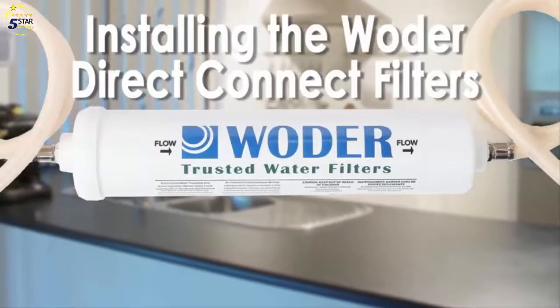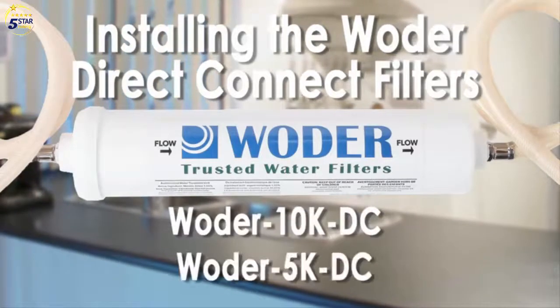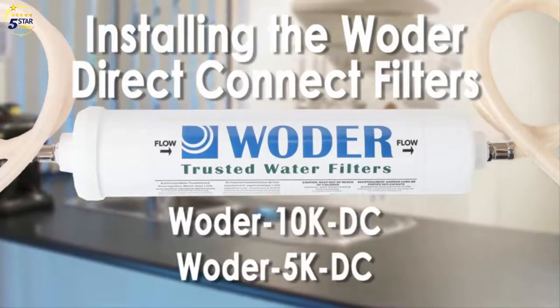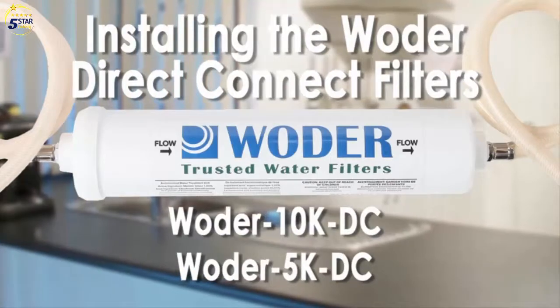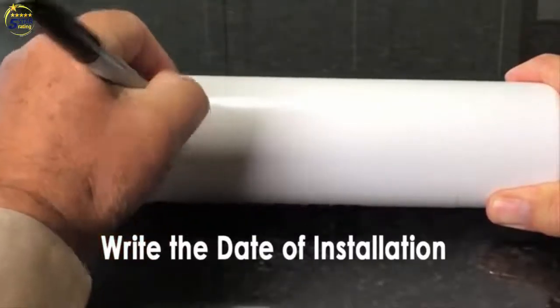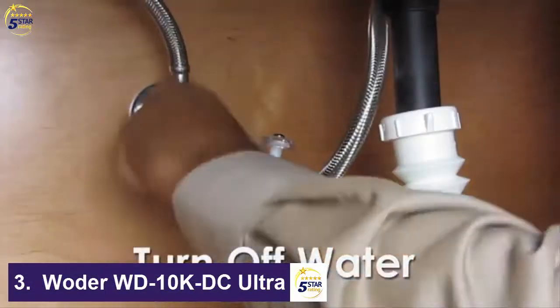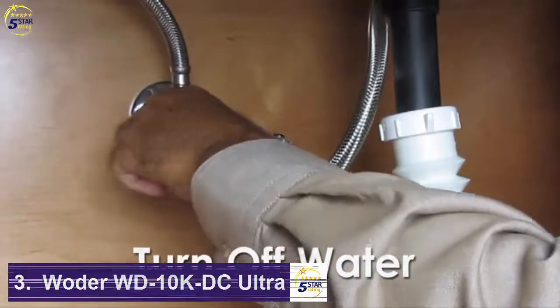In this video, we'll go over the steps for installing the Woder Direct Connect water filters. The procedures are the same for both the Woder 10K and 5K Direct Connect type filters. Start by writing the date of installation on the filter for future reference. Next, turn off the cold water supply to your sink.